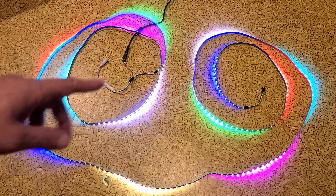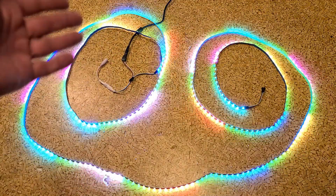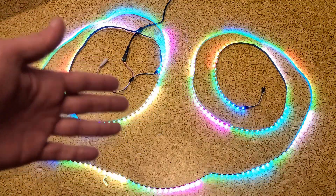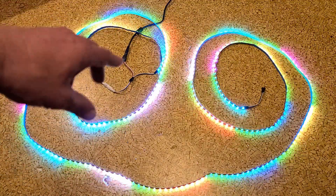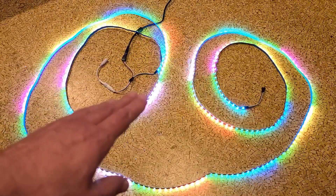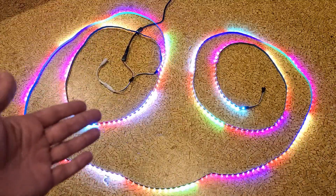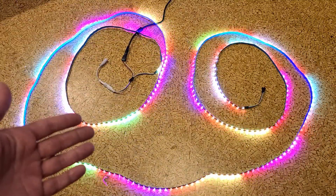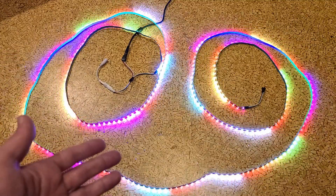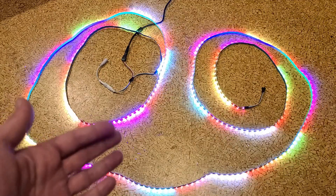You don't really want to run through that because this is a 40-watt LED strip if you're running all white. So you have a big voltage drop, and you really need to take the power supply and connect it to both ends — the plus and minus to both ends of the strip — to overcome that. But as you can see, most people, including me, will just run it in some type of animated mode, so you'll almost never run into that issue where you want it to be all white.